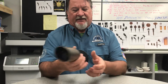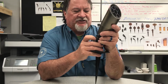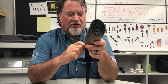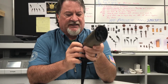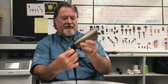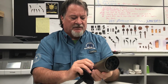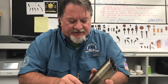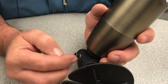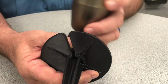Pretty proud of that. Now the other thing is I've come up with a method of adjustment. So as I turn and release pressure on the thumb nut here, every fixture does this. Now this fixture will go all the way, right, to 180 to 180. It doesn't lock in place like most fixtures like this. So it goes 180. But when I release the pressure, there is a removable plate right here. It releases a cam nut on the inside, which allows this to spin, okay?